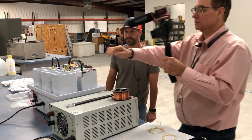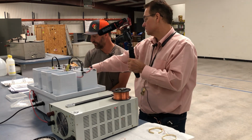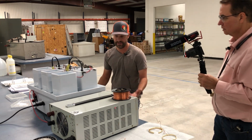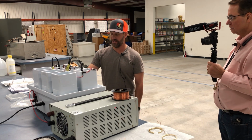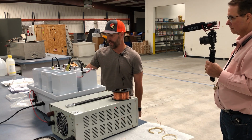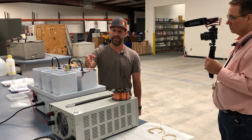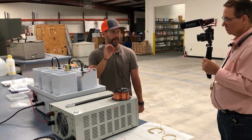So this is just distilled water, and is the rinse distilled water too? Always distilled, or deionized. You never want to have tap water, because if we just cleaned the part after neutralizing and then go into tap water, we're depositing metals on that surface. And then we're going to go into this bath, contaminate the bath, and probably get a lot of little spotting and stuff.